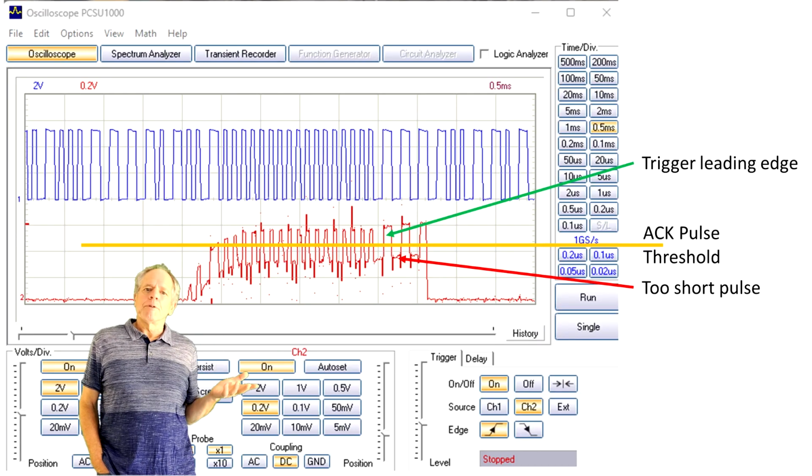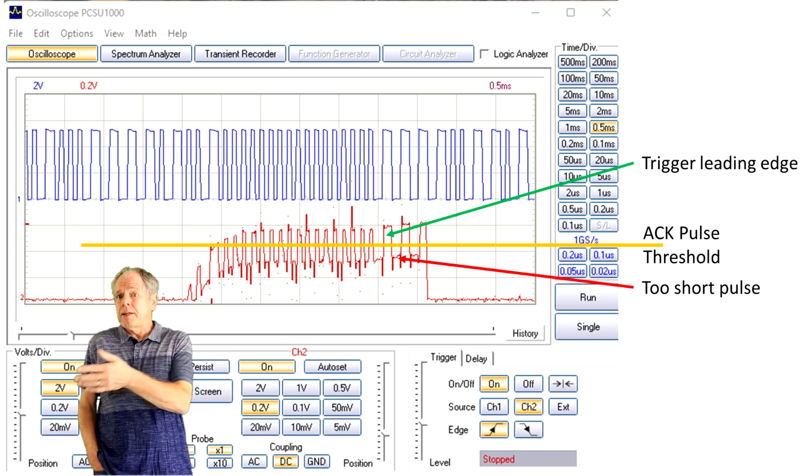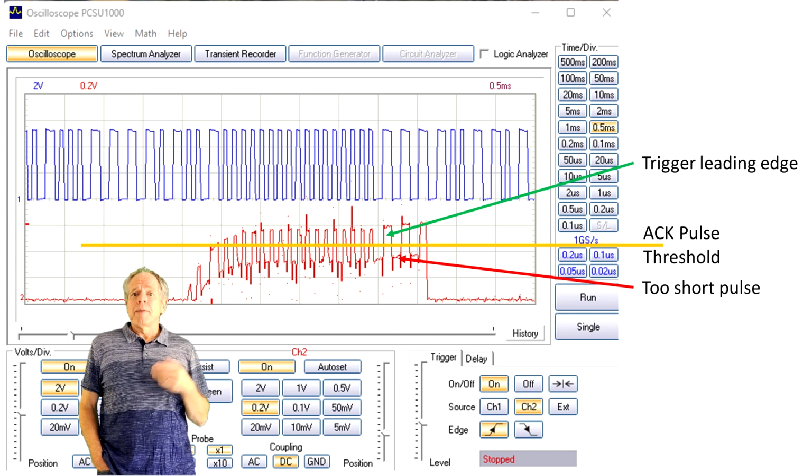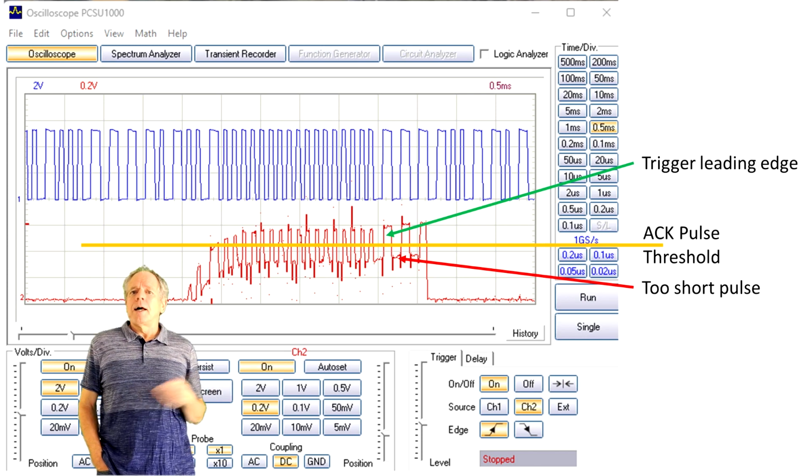With the significant difference between the measured values from each channel of the IBT-2, so from one half bit to the other, this logic will fail. What happens is that the function detects a current and starts the counting. Unfortunately, already the very next half bit, which is measured by the other channel, does not report a current that is higher than the threshold value, and the pulse is discarded. As a result, no ACK pulse is ever detected and reading out a decoder CV value will fail.